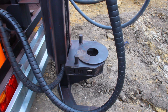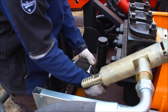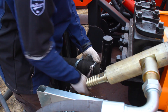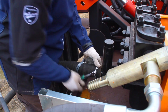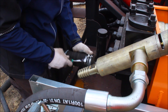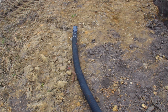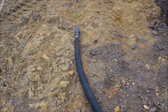The next step is to insert the ring in the professional drilling table. In order to set up the pump, you connect the hose to the pump and fix it with the clamps. You need to tighten three clamps in order to fix the hose to the mud pump. This is the pressure and suction hose which is being connected to the drilling rig right now.